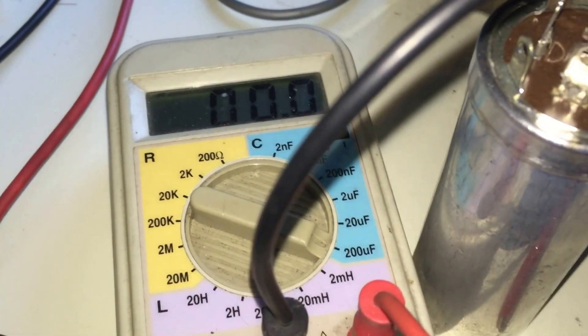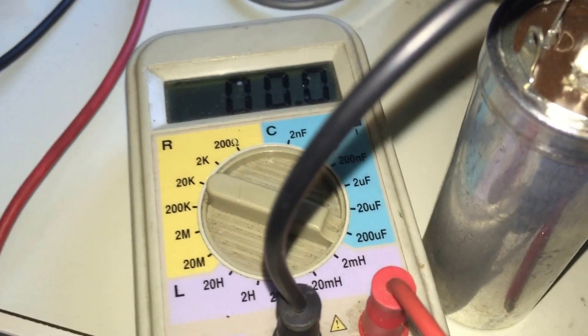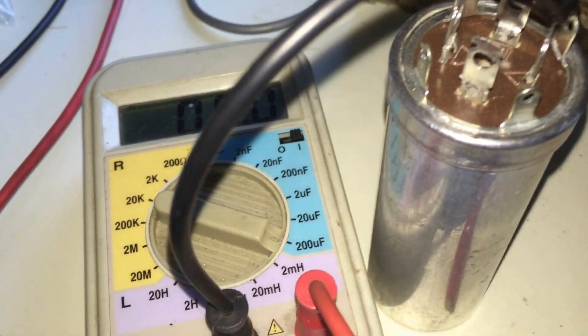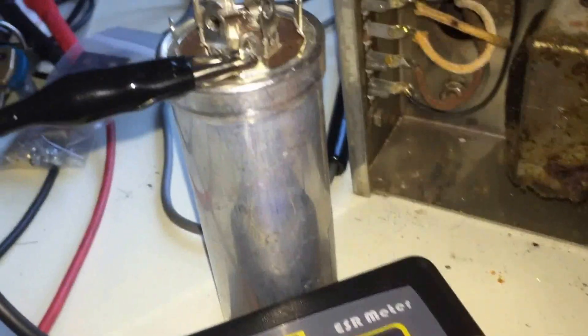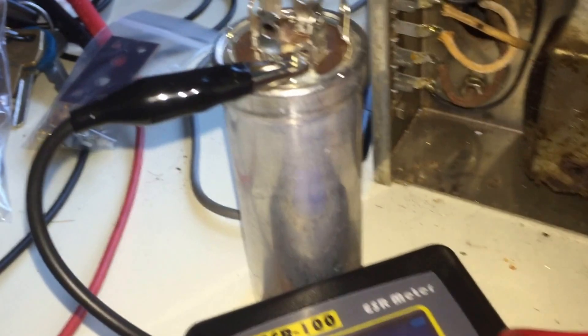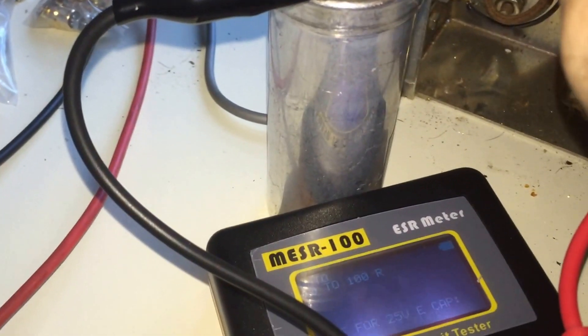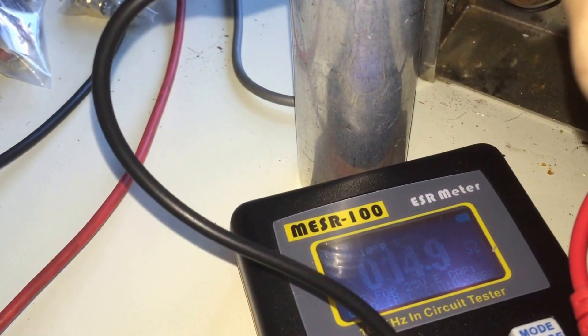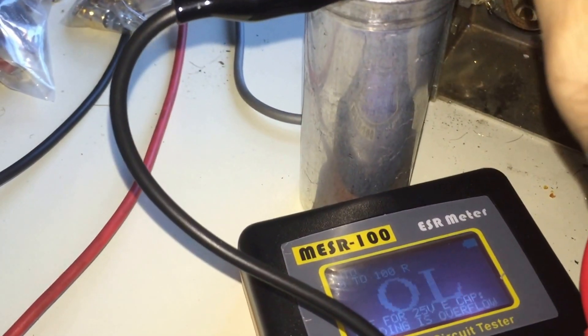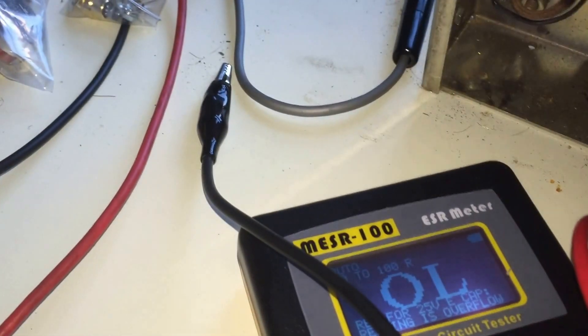We have 30, so everything's good. What I'd like to do — even though we're not using the old one — is do an ESR comparison on this new one and compare it to the one that was in there. For a capacitor this size we're expecting a couple of ohms or less; anything under about 2.5 ohms would be more than sufficient. We got 1.8, 2.0, 1.7, and 1.5. The 2.0 is the square one.